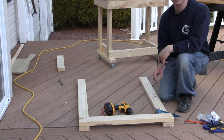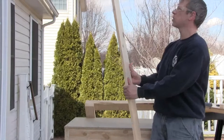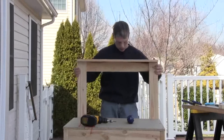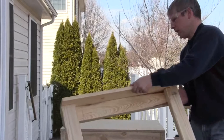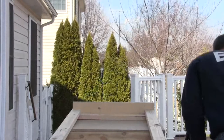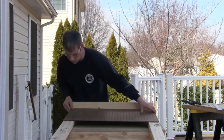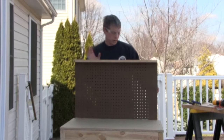I'm using my speed square on the back edge to make sure everything is square. The only really nice piece of wood I bought is a 1x6 — I'll cut that across to create a shelf with a place to put the light underneath, which will neaten it up. Now I'll put the framework up and lay the pegboard across it. I'll use the existing holes in the pegboard and just run some sheetrock screws right through those holes into the framework. It fits perfectly.